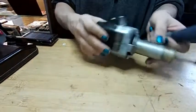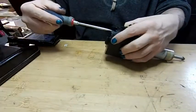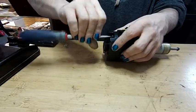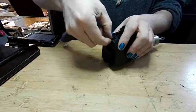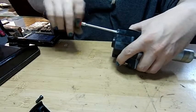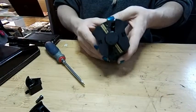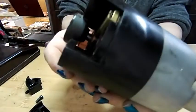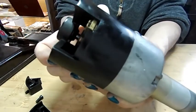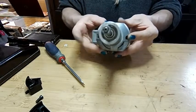To get these motors apart is pretty easy. The first thing you're going to want to do is take these two covers off the back — this is where your brushes are, and it requires just a straight screwdriver. Once you have that apart, you can see down in there — see how gritty and nasty that looks? It's in pretty bad shape. The next thing you're going to want to do is take out these two screws that hold the housing together.